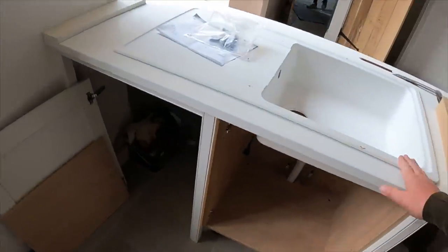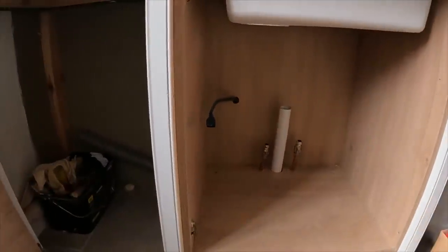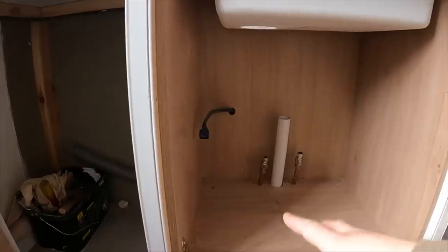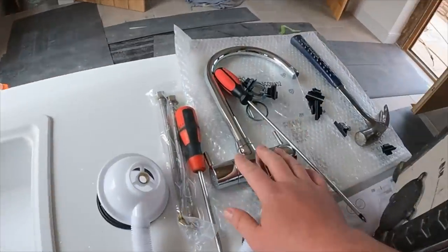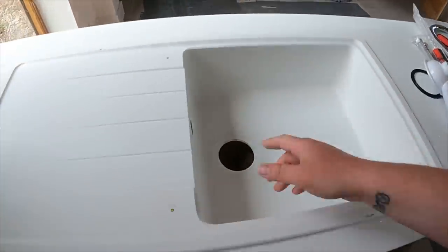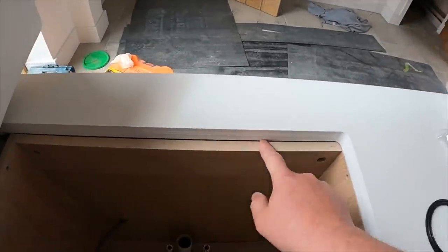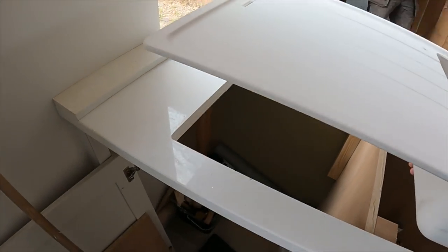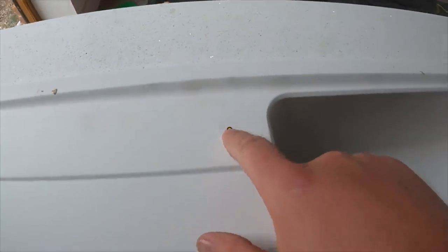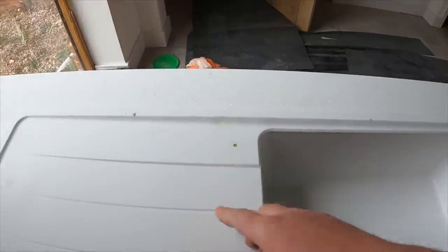What we've come today for is to get this sink unit in. It's fairly straightforward — we're going to have a washing machine on one side. Then we get this piped up, connected up, and get this set in. This is the sink going into this unit. You've got the tap, you've got the waste, you've got the clips. I'm not sure if we're going to be able to use the clips completely because we've got this lip down the back, so the clip would go onto the bottom of the granite. First off, let's get the tap set. These are meant to be able to knock them out, but I just drill them out because I just don't like knocking them out in case anything goes wrong.